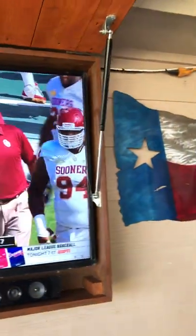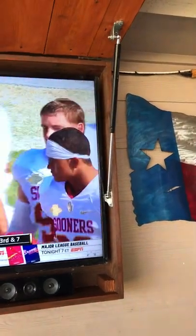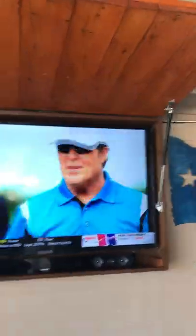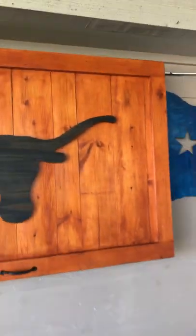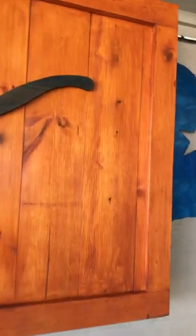These lift shocks I got off Amazon — they're 20-inch lift shocks and they're 100 pounds each, which is overkill. I watched another video of a guy who used them and his door looked a lot lighter than what I have, so that's why I went with them. But I just placed an order for some 65-pound, 20-inch ones, and hopefully that won't be so tight on my door. Right now it's a little hard to pull down — not too bad, but you've got to put a little muscle in there to bring it down.